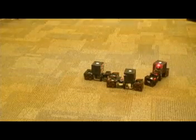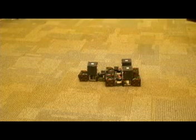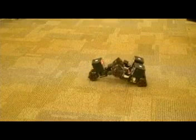The control used for this demonstration involves two levels of coordination. The lowest level occurs between the five modules attached within a cluster; commands to coordinate the motions of the servos in that cluster occur using the robotics bus protocol, built on top of CAN bus. The higher level of coordination is between each cluster, using infrared emitters and detectors to detect docking and synchronize coordinated motion among multiple clusters, such as standing and walking.